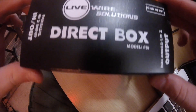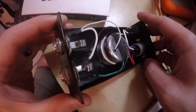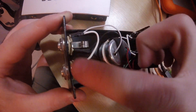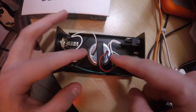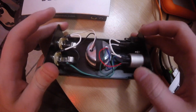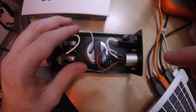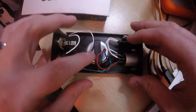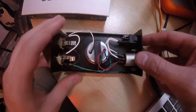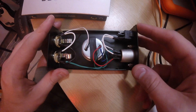I went ahead and took the screws off so we can take a look inside. Here's the guts — everything you would see inside of any DI box. There are our inputs and outputs, and you can see that it's just bridged across with these cables here — this is how you get a direct pass-through from any DI box. Then it leads into this part right here, which is what makes the DI box what it is: a step-down transformer. You'll find all different kinds of transformers in all different kinds of DI boxes, but this is the major component. It's taking the high impedance load of your instrument and stepping it down to a microphone impedance on this end. You can see the wires leading into the transformer and the wires leading out that are then feeding the XLR output, and the jump wires that go to our ground lift switch. If you have some kind of weird buzz or hum when you plug something in, you can use this switch to try and eliminate the hum and lift the ground.